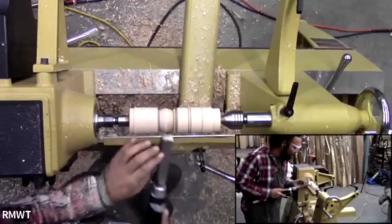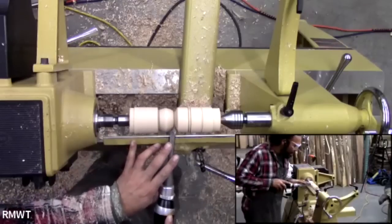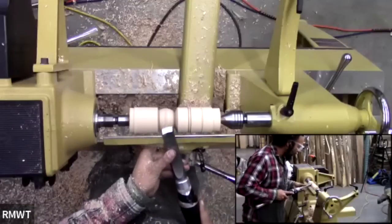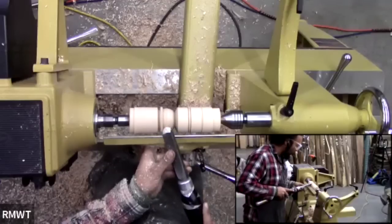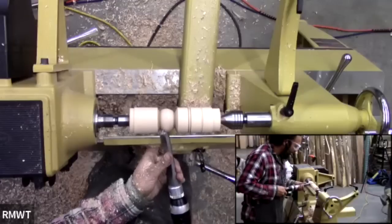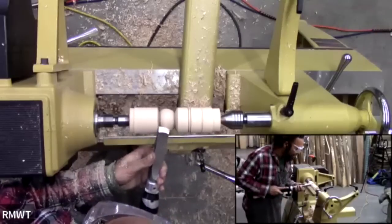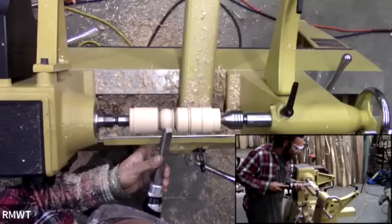but I can also lead going overhand too, and flipping this around to the long point of the tool. And do the same thing on the other side. And I find that, again, when I'm starting a bead going to the left and to the right with the short point of the tool, that's when I get my more convex shape that I'd like. Nice full rounded bead. So it's more spherical shaped, okay? Practicing a wider spherical shaped bead is going to be the thing that allows you to get an understanding of what's going on with the tool a little bit better.